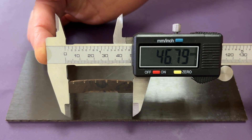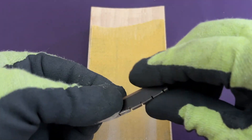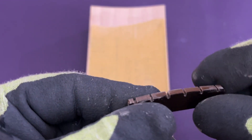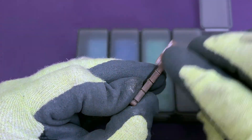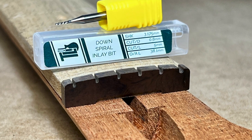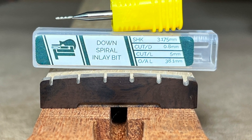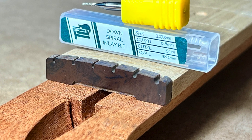I designed all these pieces to be slightly oversized, to allow for final sizing and shaping to fit correctly to the actual fretboard and neck as made. If you need to reduce the overall height and adjust the shape of the radiused upper face, you can do this using a radius block and self-adhesive abrasive paper. I'm using foam backed abrasive strips for final preparation of the cut edge. Well that's all for this video, so I hope you gleaned some useful tips and insights on how to tackle making this intricate part of Brian May's Red Special Guitar. Thank you very much for watching, and please look out for future videos.